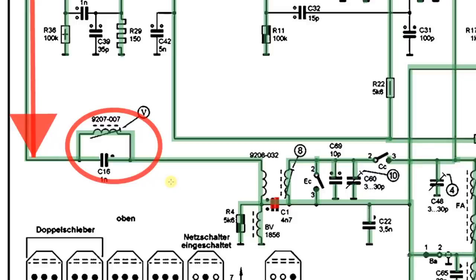The IF trap does the following: inside this radio you are receiving frequencies and generating frequencies. You are creating an IF frequency — 460 kilohertz — which is the IF frequency for this particular radio. That IF frequency is the most important frequency of the whole lot, because that's the one that you allow to go through the various stages of the radio. That is the one that will ultimately carry your station's audio information.